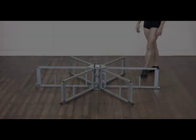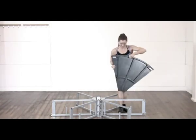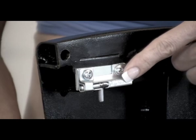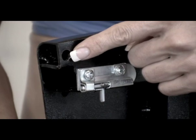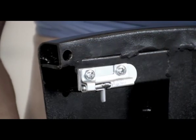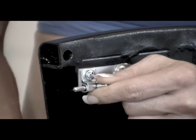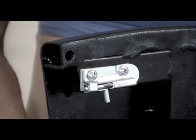Take a stage floor plate and examine it. Underneath it has two sprung catchers, and next to those catchers are small holes to receive the locating pins installed at the ends of the subframes. Try activating the sprung catchers to see how they operate. When released, the catch pin sticks out of the edge of the floor plate. When relocked, the pin is retracted.